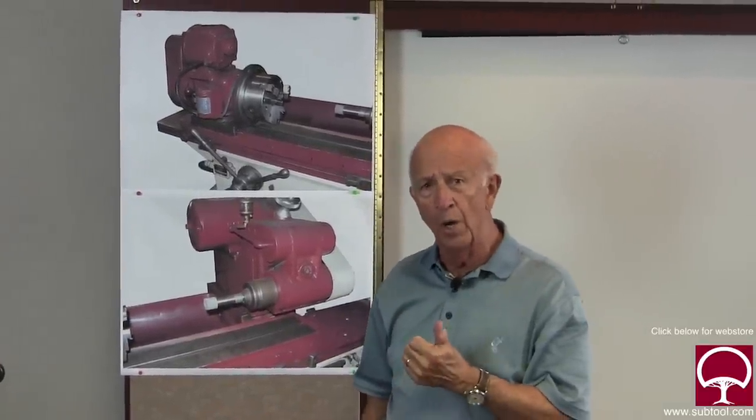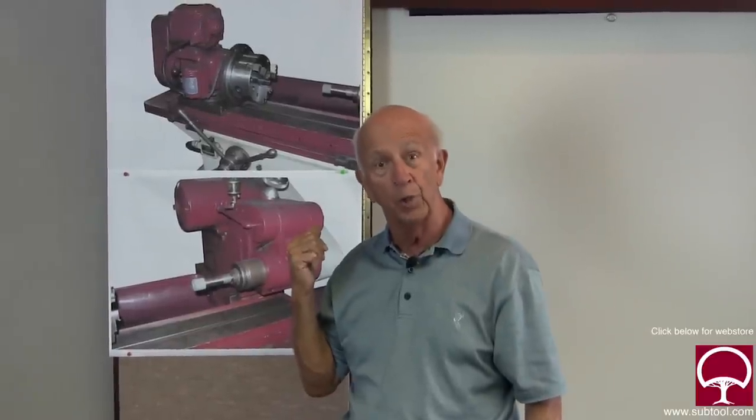When I was in a shop, I always checked the machine out before I got started. I gathered all my tools, made sure I had everything set up so I wasn't frustrated, and not only did the job turn out great, I had a lot of fun doing it. So keep in mind the things I mentioned. We're also going to do another video where we go out back and grind a couple of parts to show how we grind them and set the machine up. We also think it's important to talk about the chuck itself — how do we hold the part, how do we make the chuck as accurate as possible within a tenth or two with no runout. There are a couple of tricks to it, and I'll explain in that next video.